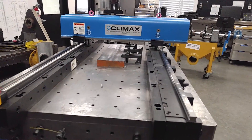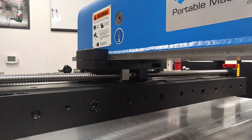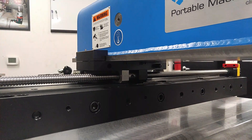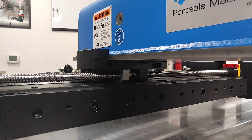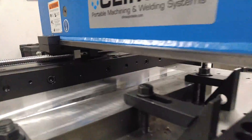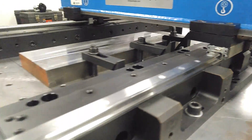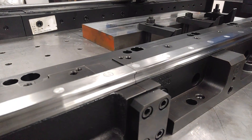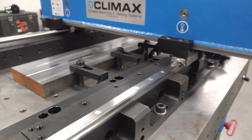When doing that, it's critical to check the joints. It is imperative that you don't test the joints under full power of the electric feed motors through the ball screw. The ball screw is so efficient and the feed motors have so much power that the skates under power will ride right over the top of one of these joints, even if it's not aligned properly, and you'll destroy the block.